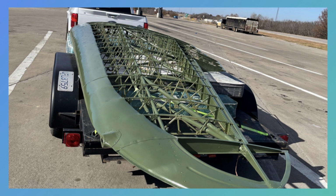How bad was the other left wing? We had to make a repair on the wing tip. How bad was the wing that was on the airplane that you replaced? It was pushed in pretty bad at the front on the leading edge. From about the front to a quarter or third of the way down, it was just crunched in. Did you get to the mounting points? No, because these formers and the ribs come in and form this front, and your spar is right here, a steel bridge. So it's repairable. Yeah, and I still have that wing, and I've got the other that matches this one.